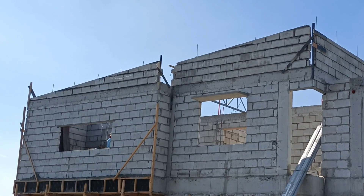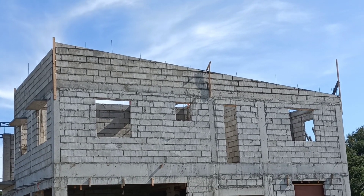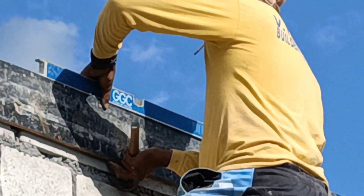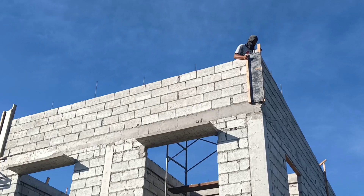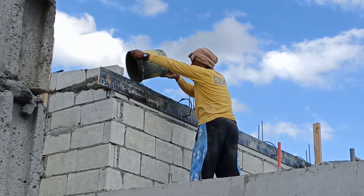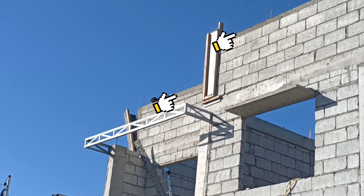This is how it looks like after being completed, and this is the inside look of these walls that they have made — on my right side of the house. Following the completion of the roof system wall, they added a smaller version of the roof beam that serves as areas where the tubulars will be placed, then attaching both corners of these walls with form works for the L-type column used in the corners of the boundary wall. Finally, it will be filled with concrete mixture and the form works removed after they have dried.